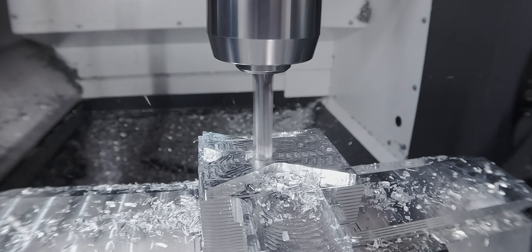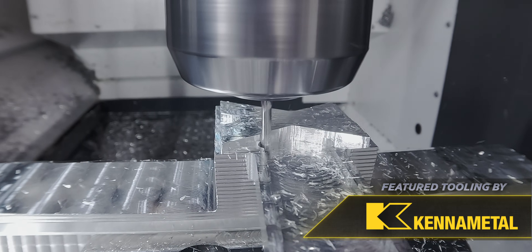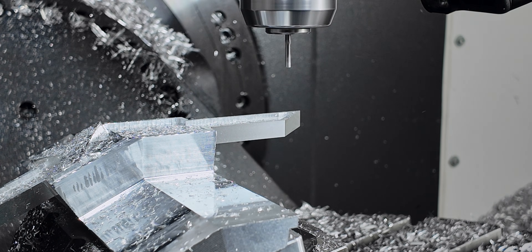Now let's talk about the finish passes because how I approach that is really important. We're trying to get a good surface finish but also do it as fast as possible. Typically when surface milling you're doing a very small stepover and it takes a lot of time — if you climb mill and conventional mill you can drastically reduce cycle time. But with this part I'm not worried about cycle time since I'm only making one. For me it's about making a good-looking part, which is something Barry really hasn't learned yet.